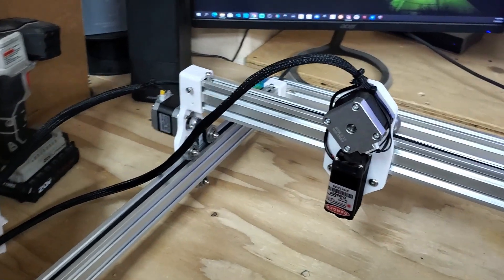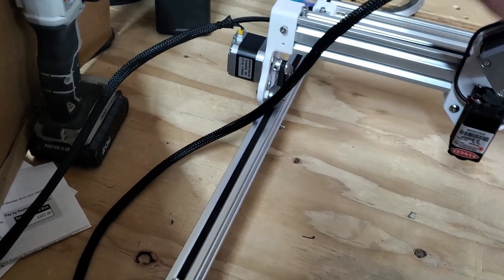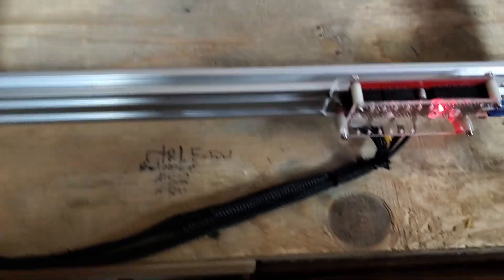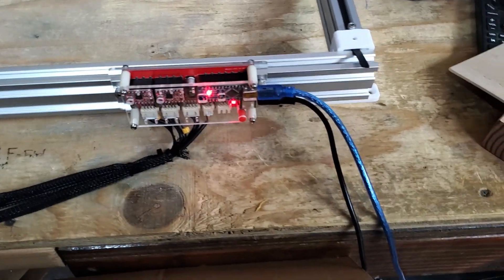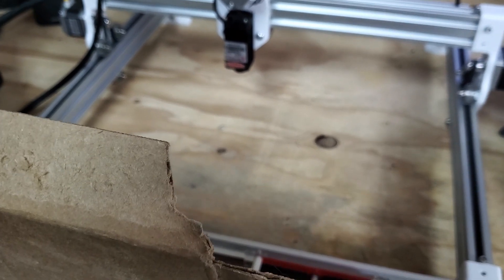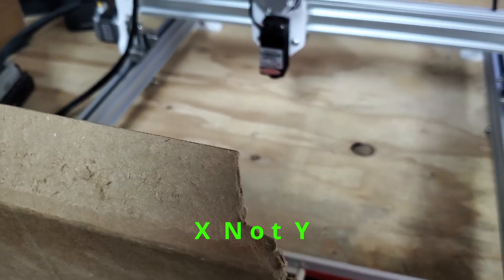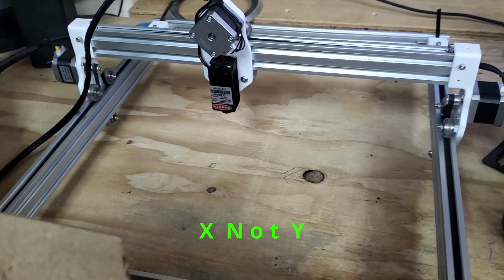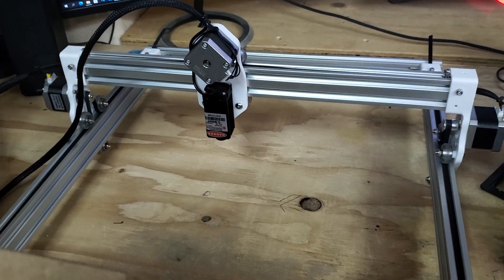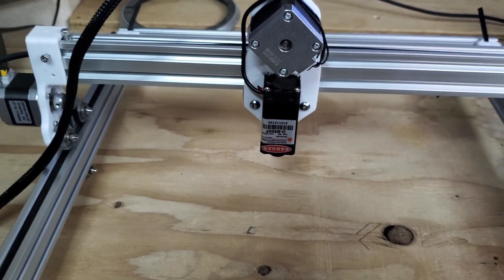Since I already had LightBurn, I got it all wired up. I had to put a couple of cable extensions on and solder one connection to make it long enough to reach the board. Got it plugged in and tethered to my computer — it runs great in LightBurn. My first burn came out upside down, so I spoke to a friend, Astro Printer, who mentioned reversing the Y cable. I found a software switch in LightBurn and it flipped the orientation correctly.